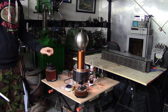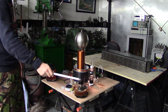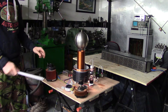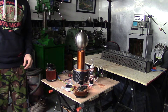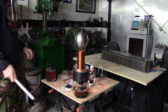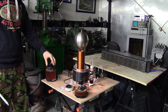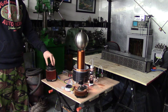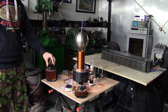This is the Variac for running the MOT over the back there, and this Variac here is preset for the filament voltage which is 6.3 volts. So that's set for 6.3 volts when the Variac over there is at 230. We'll crank it up — and there you go. That's 80% in at the moment.